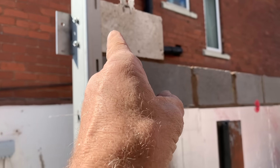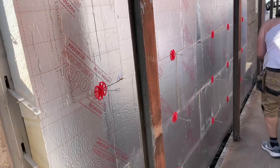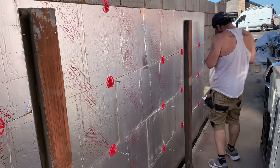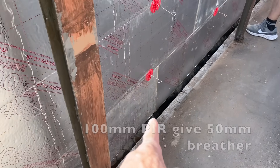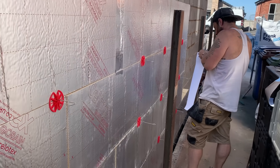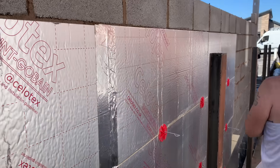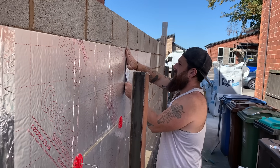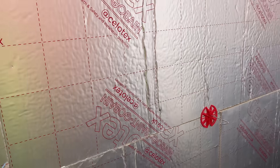Okay, that's our wall plate height — this is the back side and we're putting in our insulation now with Celotex CW4000. Can't just use any kind of PIR — it's got to be this; seemingly it's good against damp. We've got a cavity tray in — so if anybody says we can't return, yes we have, it's there. We're putting in our silver foil tape which stops any moisture coming through. We're up to this height and the reason it goes higher there is because we've got a parapet wall going on top — we can't bring any guttering over onto the neighbour's side.